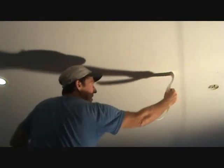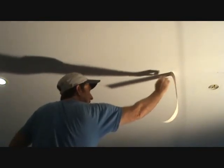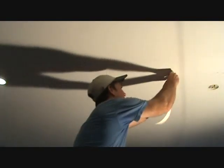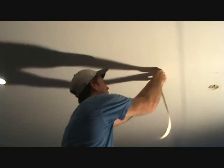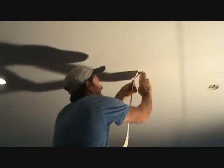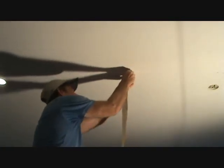Now I'll just keep on going over to the left a little bit and work my way down. If this tape was loose enough, I should be able to just zip it right across here. And if not, I can cut it with a sharp sheetrock knife — just the loose bits — and work it with a putty knife. But I'm just going to be kind of careful here and see if I can mosey it on down. See right there — it's coming easier than there, so it wasn't stuck as hard there. I could probably zip this all the way across the room, but I don't necessarily want to do that.